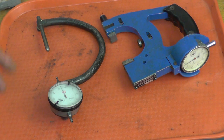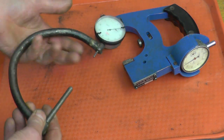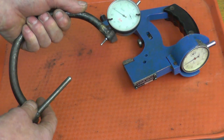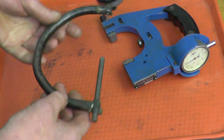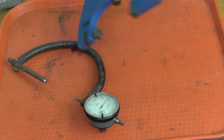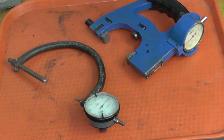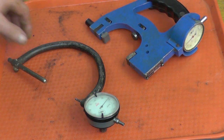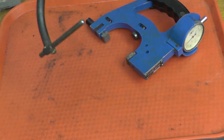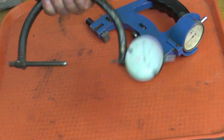I was tidying some drawers up and I've come across this — I think I've showed it before. It's a comparator gauge. You would set that to whatever diameter you wanted and use it to check the diameter of a shaft. It's obviously homemade and it's had a lot of use by the wear on it. And that's the modern day equivalent. They both do exactly the same job. That one there's got a stop on so you get down in the centre of the shaft, and by feel you would be able to gauge your shaft very accurately with that.